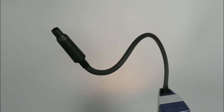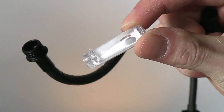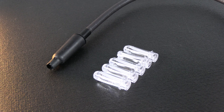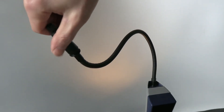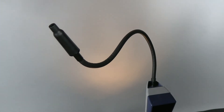A filter is pre-installed in the AST300 ppm probe tip. If the filter looks dirty, gets wet, or clogged, replace it with one of the included replacement filters. A wet filter can be reused once it dries. Using the AST300 ppm without a filter can damage the sensor, so make sure a filter is always installed.